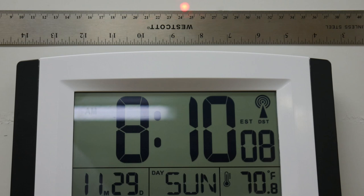Here's a preliminary test I ran a couple of days ago. The torsion balance was allowed to sit overnight and stabilize, and it was showing a steady reading of about 242 millimeters. Now you'll see it move a little bit right at first because just my presence out there setting up the time lapse is enough to disturb it. But about 45 minutes into this, I actually move the weights from the west position to the east position. And when I do that, you'll see a very dramatic change in the behavior of this thing.